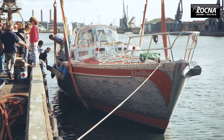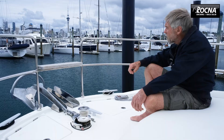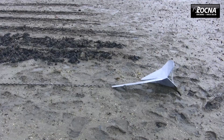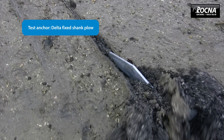In those days I was anchoring mostly on a Delta, a Delta 44. I had two Deltas on board, two CQRs, a Bruce, a Danforth style, and a very big large emergency pick. But we just had so much trouble. We dragged anchors, we dragged Deltas that were fully set. They were a metre down in the mud in the Chesapeake and we were still dragging, still pulling those things through the mud.